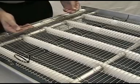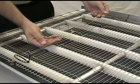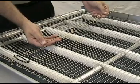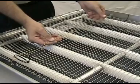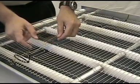Here we show a new belt to be joined using the full strand method of splicing. Before you begin the splicing procedure, you'll need to secure the belt on the conveyor with some plastic cable ties, as shown here. This should be done on the left and right sides of the belt near the edges of the conveyor. This will hold the belt in place once you've got it aligned and the drive components are in the proper position to run on your conveyor.